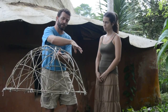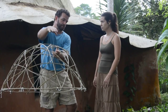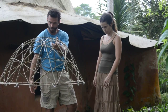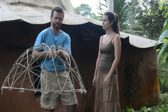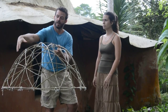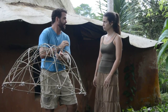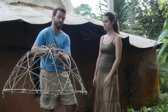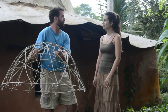Also, the other technologies we're going to be putting into this structure can also be learned. We're going to be learning how to do the foundation for drainage, which is a French drain system. We're also going to be learning wattle and daub, which is the stem wall — the wall that's going to go underneath this — a very old technique, tried and true, especially in Europe. Then we're going to be learning the cob technique to fill in the gaps all around the dome. And then we're going to weatherproof the entire dome with what's called ferro cement or nylon cement, which is the newest, most sustainable way to use cement.